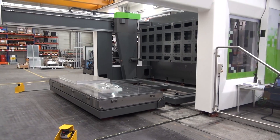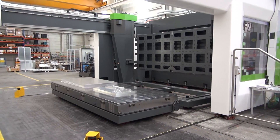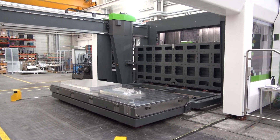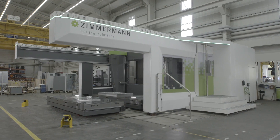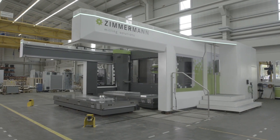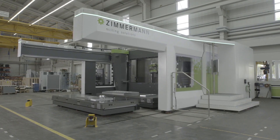The horizontal series from Zimmermann is designed for the purpose of machining large structural aerospace components. The innovative pallet design forms an integral part of the structural rigidity of the machine itself. As a consequence, the pallet wall and machine column being mounted to a common base, the Zimmermann horizontal machines do not require bespoke foundations to complete structural integrity.